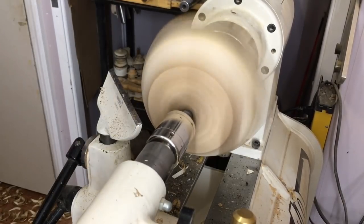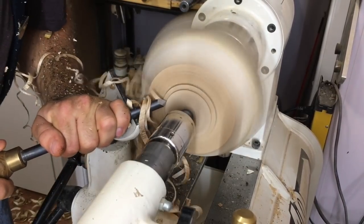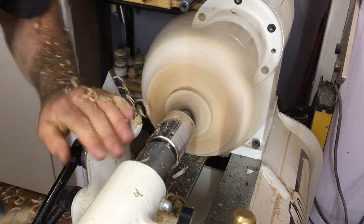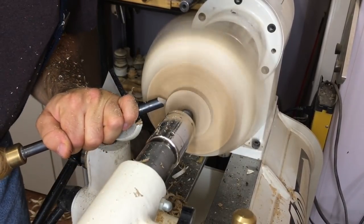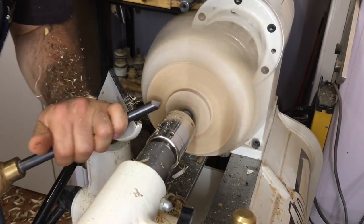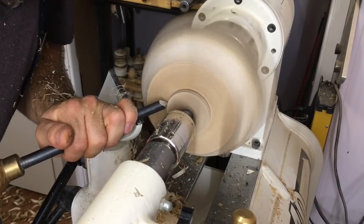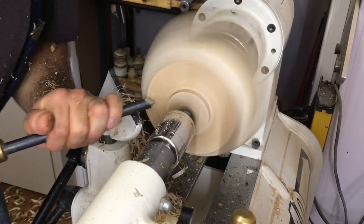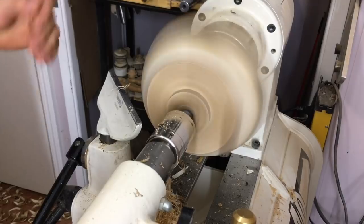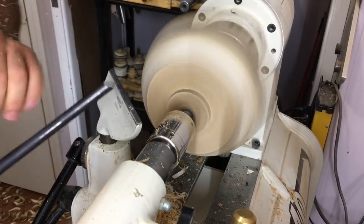Okay, we're totally round now — let's form a tenon. Switching over to the 40-40. I'm going to make a nice clean cut on the bottom, then refine the tenon so we get that nice 90-degree angle. One more little cut — there, that should do it. I'll clean up the bottom a little bit, not going to cut too close to that live center yet. The bowl is looking a little dumpy so I'm going to make it a smoother curve, and I'm actually going to put a little foot on the bottom as well.